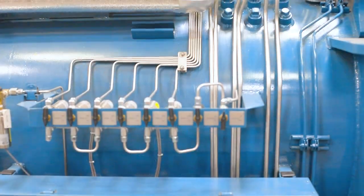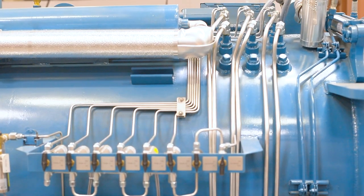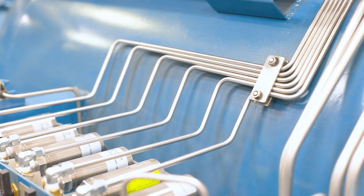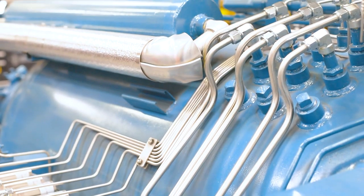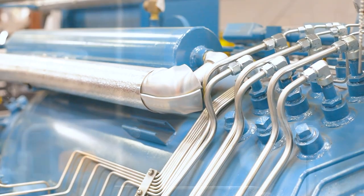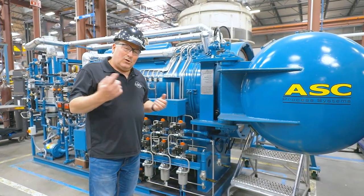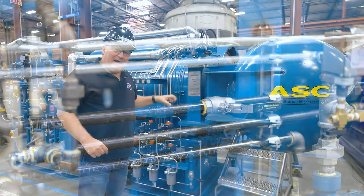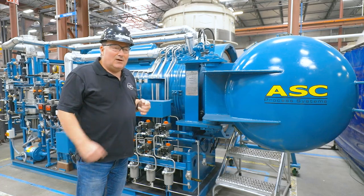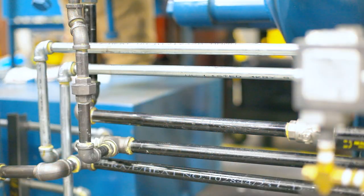You're going to learn how to bend this tubing really nicely. Most of these autoclaves have a lot of skill involved by the mechanic in terms of creating a really nice plumbing job — we're looking for straight angles, 90 degrees. We're going to be making header pipe headers; we typically use black pipe for most of the vacuum systems and the individual pressure systems of the autoclave, but you'll also get involved in running galvanized pipe for water cooling applications and things like that.